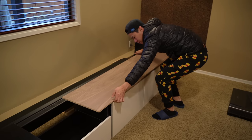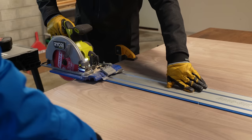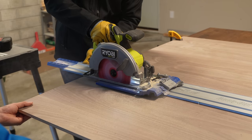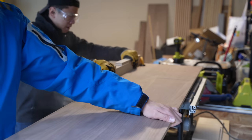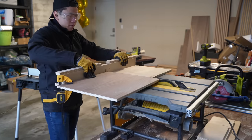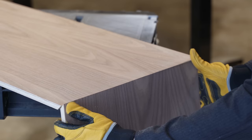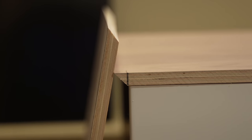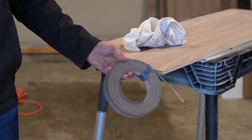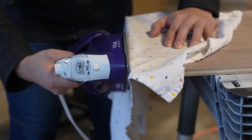With my newfound table saw skills, I wanted to take this to the next level by adding a walnut wrap on top. We got a special plywood with a walnut veneer from a specialty plywood store. The cool thing we're doing is making a waterfall edge effect where the grain continues from the top piece to the side piece — we cut both panels at a 45-degree angle, which would have been very hard to get right without a table saw. After fitting them on top and making sure they're the right size, we added edge banding to hide the plywood, which takes a lot of time gluing and trimming to make it look like solid wood.